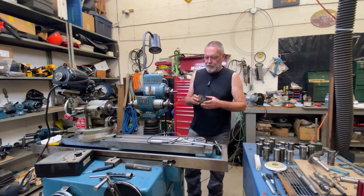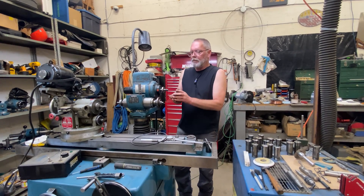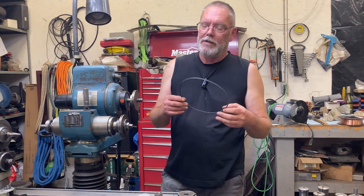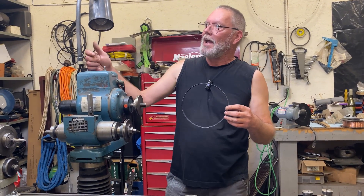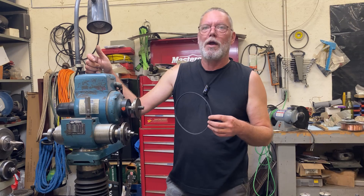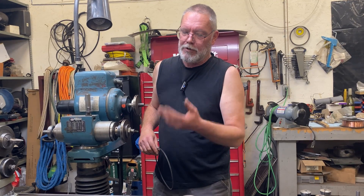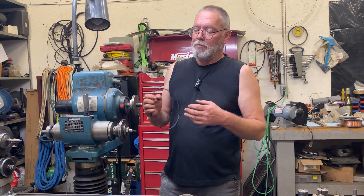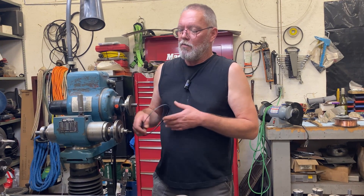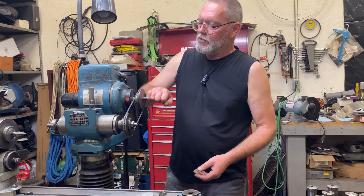Putting a different size pulley on today — this is actually going to bring the RPM of my grinding wheel up to the proper RPM. I've been running it a little slowly. I finally got a new belt; it took me forever to find it — it is not a common belt. The other belt was 30 years old, had been stalled on a couple of times, had some wear. I wanted a backup, and it was also a little on the small side so I wasn't able to get a one-to-one ratio to get my grinding wheel up to the speed I wanted. Because we're going to be grinding with a pretty small diameter wheel today, I didn't want to be running it slowly or I wouldn't get as nice a finish. So finally I have my new belt — it's big enough to allow me to use equal-size pulleys, and I'm pretty excited about that.